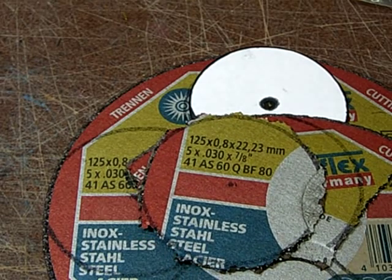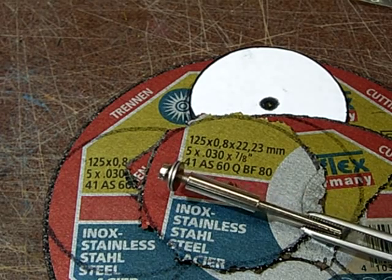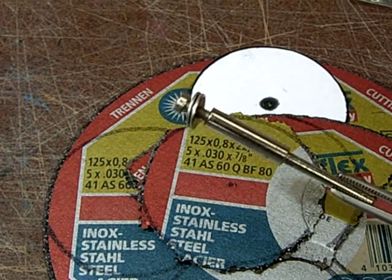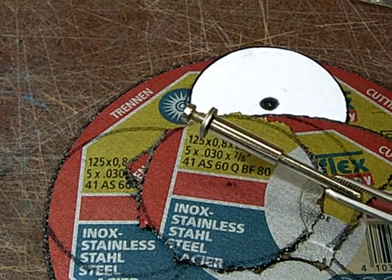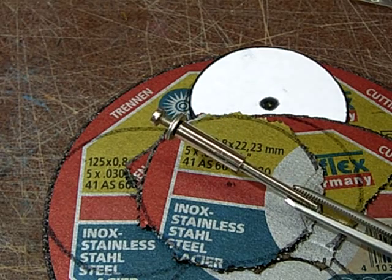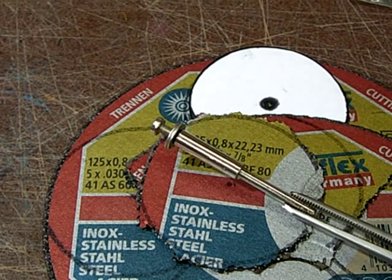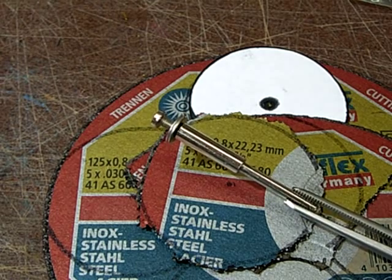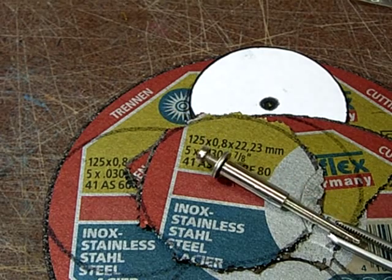And what you also need, if you want to mount it, is a so-called mandrel. This is a part which looks like this, and there you screw the grinding disc on at the top, and the lower end you attach in your mini drill. You want to get the biggest diameter they have. They come in 3.17 and 2 point something millimeter. 2.1 is a bit flimsy, so take the 3 millimeter variant, and also the 3 millimeter screw on top.